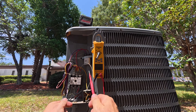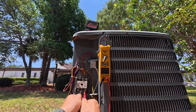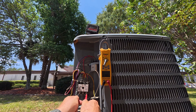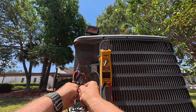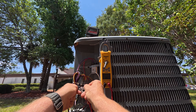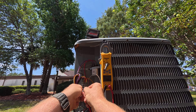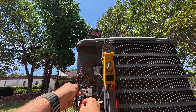Can y'all see this? Hopefully you can. Three-phase — we've got 211, 212, 211 coming in. We should have the same thing coming through: 211, 120, 73. Alright, so it's just not passing through.